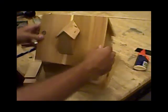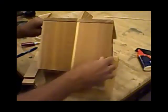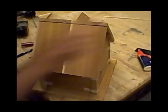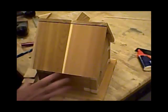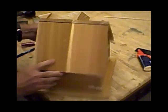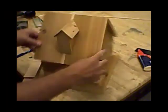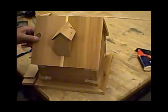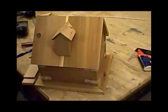When you do your shingling, you obviously have two sides of the roof that you've got to shingle. This is the easy side because you don't have anything in the way — you're just going to run five rows of shingles all the way up to the top. I would suggest that you do this side first, but I'm going to do this side so I can show you how you work around the dormer, or two dormers if you happen to have two. The principle is exactly the same; you just won't need to cut anything on the other side.